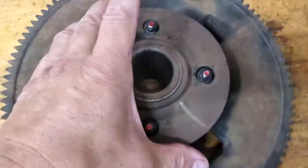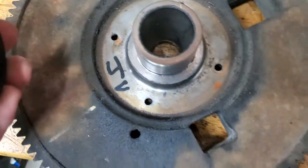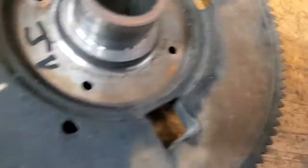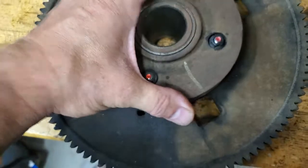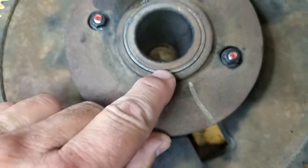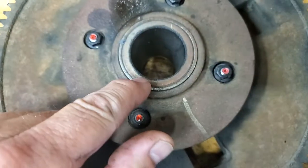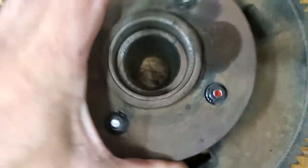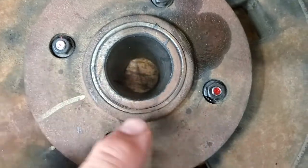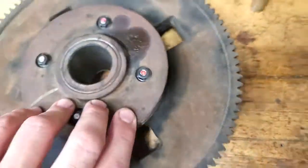All right, so now we slide it on this piece — I cleaned this one up. Remember it rotates a little bit, that's what that bushing's there for. I'm gonna put a real thin film of grease — very thin. Nice and slippery, cleaned up, got a little bit of lube in there, flip it over.